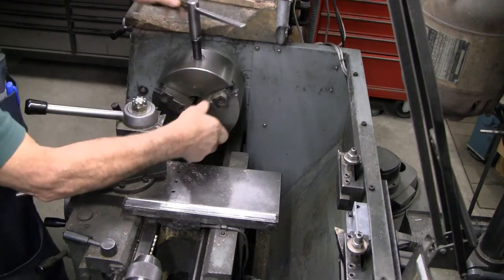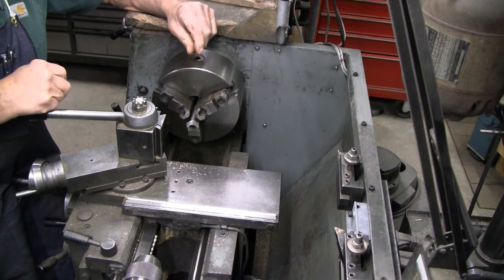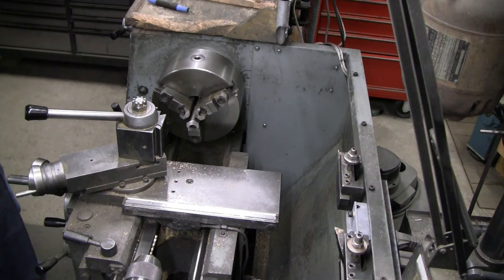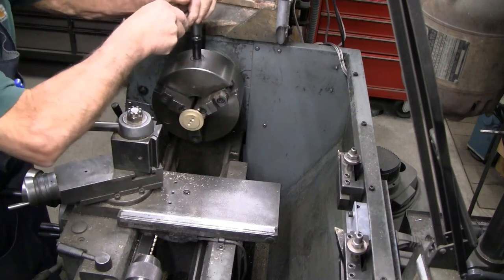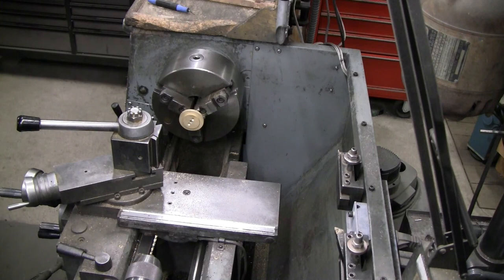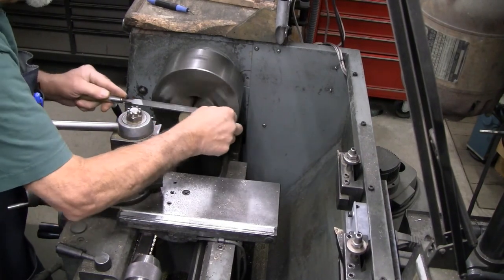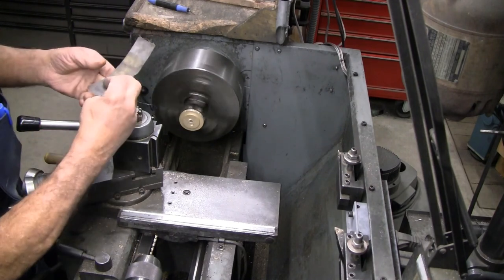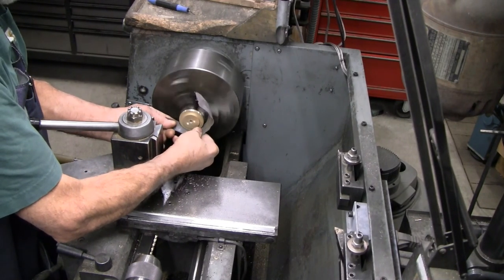Assuming you're working to a mark on a drill bit rather than counting the marks on the crank on the tailstock, it's a lot faster just to loosen the tailstock, pull it out, clear your chips, and push back in for another go. Let's leave that in there. Slow that down. And take a light touch with the file on these surfaces. Just want to knock burrs off. Here's a worn out piece of 220 or a 180 abrasive cloth. Just polish that up in there.